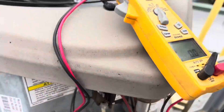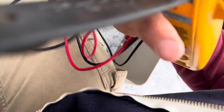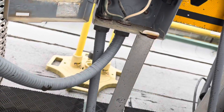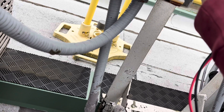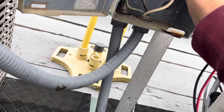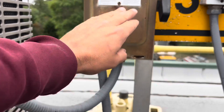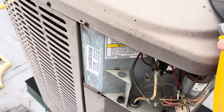Let's see if we have power here. Okay, we have no incoming power. Let's just test these fuses — I wonder if somebody just turned a breaker off. If it was shorted to ground it would have blown these fuses. Let's tone them out. Okay, this fuse is blown... actually they're both good. So we're looking for a breaker. I'm going to keep this disconnect off and we're going to just real quick test for shorts to ground before we go finding a breaker.